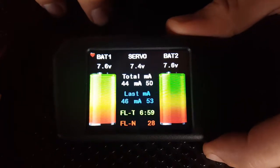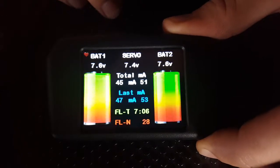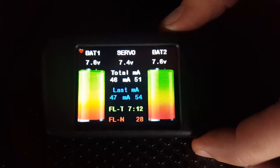When using the RS system, if you're using Li-Pos or Li-On batteries, we recommend regulating to 7.4 volts. If you're using Li-Fe batteries, we recommend regulating to 6 volts. That's all for the setup of the regulator. There'll be more videos coming shortly. Thank you.